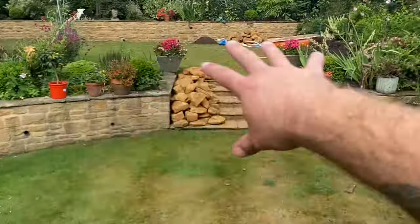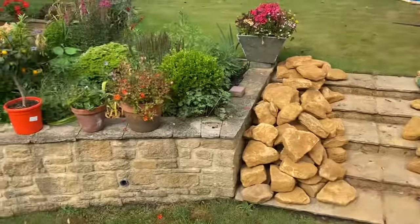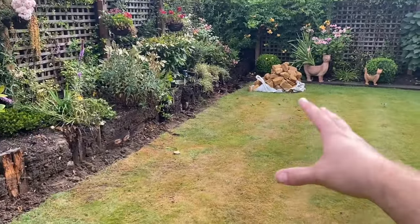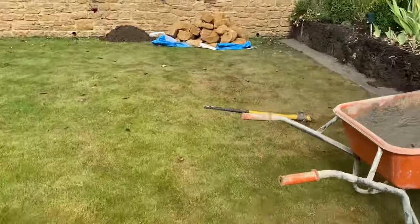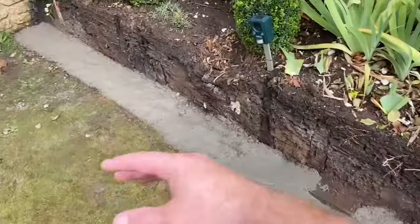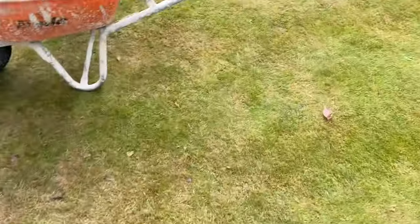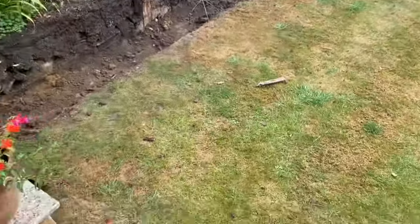60 blocks, all the coping stones, because you just couldn't bring them into the garden. But anyway, we sorted out all the stone, got some various piles, didn't put too much on the grass because obviously I want to try and preserve as much of it as possible. Just got the first footing in up here, so it's over about 200 deep, obviously left an inch on top of it. And then over here, we're just cracking on with digging it out.